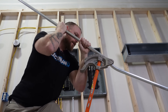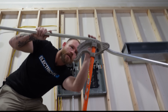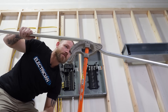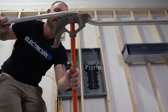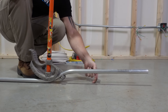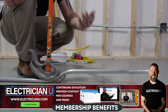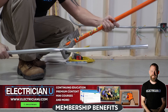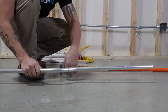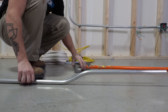Here we go — little by little. Now I'm going to line up my 30 degrees again, so I know the 30 degree line is parallel with that conduit. That looks good right there. I'm going to flip this back around and put it on the ground — to me, that looks like where the box is going to be. If it's a little off, a lot of times you can push down in the middle and it'll pop that side up, which translates it going back down. So you can work with the bends a little — just don't hammer on it, but you can do little adjustments.